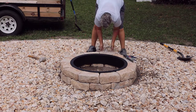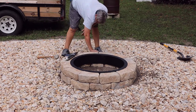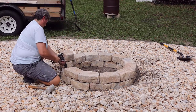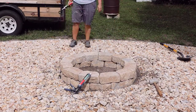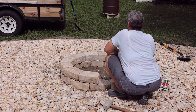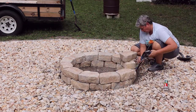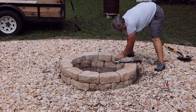The construction glue is applied through a caulking gun. If you don't have much experience with caulking guns, be careful with air bubbles in the glue — when you pierce the tube seal and begin squeezing, sometimes an air bubble will cause the glue to keep coming out even when you're not squeezing the trigger. Release the caulk trigger each time and it will slow the glue from coming out. Once the air bubble passes, the glue will stop running. I took one block off at a time on the second level and put the glue in a circle on the first level blocks, then repeated this for all blocks, tapping each one with a mallet to spread the glue more evenly.